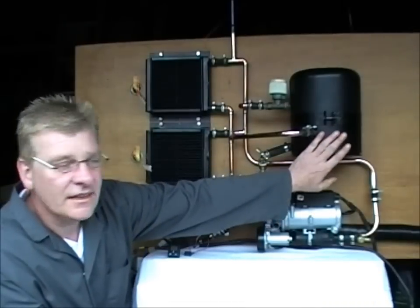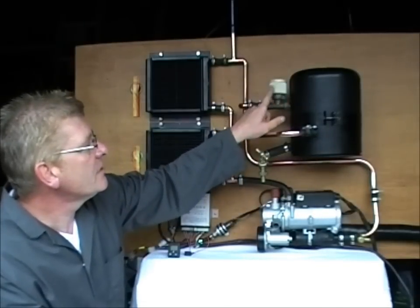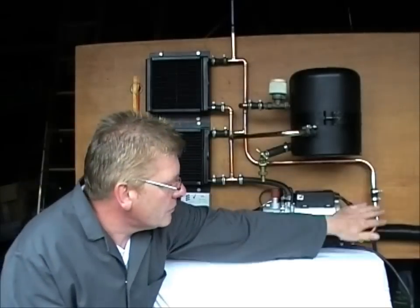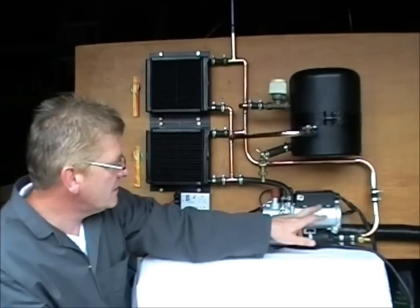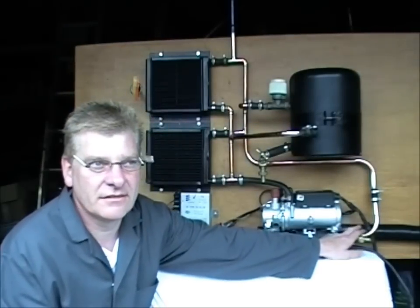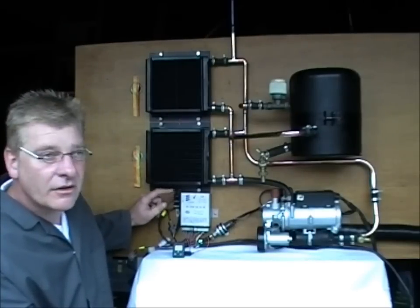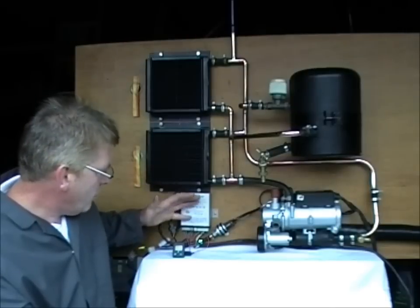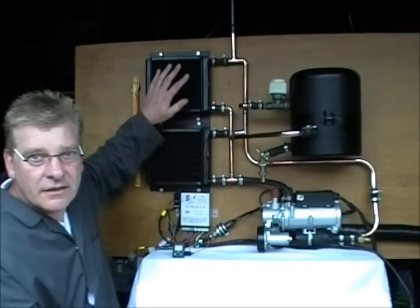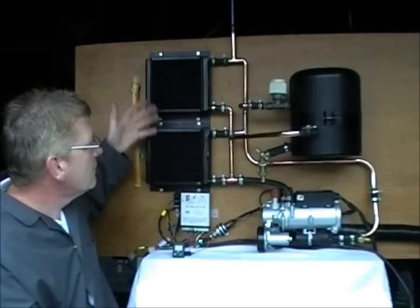On our hot water tank we do the same. We come into the coils inside and we go through a thermostat here that we can adjust for what temperature of water we want, and again it all returns back and gets reheated and goes round. We've actually put just a bit of extra silencer on it. This is our control unit, and we've got 3 sets of fuses. We've wired this one so that we can have it putting these heat exchangers on at around 50 degrees. These will open up and start blowing.